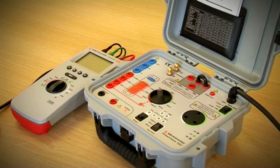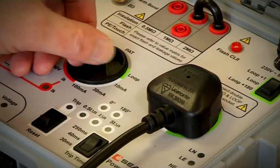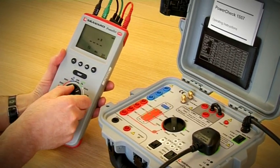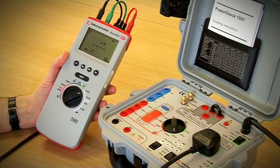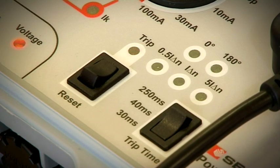To check the operation of an RCD tester, plug the tester into the PowerCheck 1557 and turn the test current to match the test current on the tester. The PowerCheck 1557 can be used on RCD protected circuits without tripping the supply RCD. Turn the dial to auto to run a series of tests and press test. Check that each test current sequence within the auto sequence matches the LEDs and that the measured trip times are within specification.